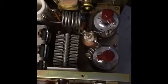I put a new capacitor in there. I had to disassemble the entire tank circuit, put new finals in, and neutralized the finals. Anyway, we're ready to go now — power will be connected and we're going to see if we can get any RF output out of this at all.